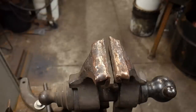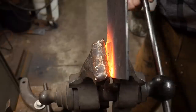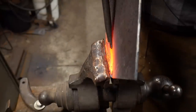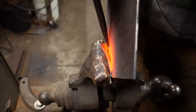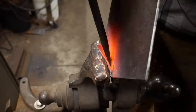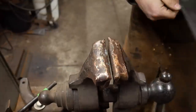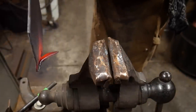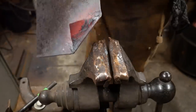I'm going to clamp down on the piece I just hammered on, pry out the plate a little bit using the slitting chisel as a bit of a wedge. We're just trying to get this process started in the right direction. Now we have enough to hook on the edge of the anvil and drive back to create that ridge. So we'll be over at the anvil next.